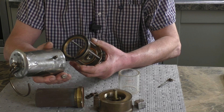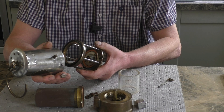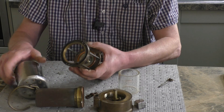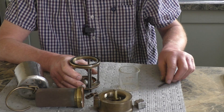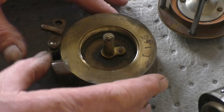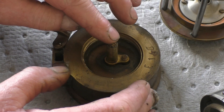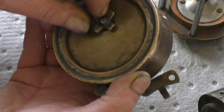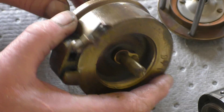This was probably used as a training lamp to train deputies in the use of the mine safety lamp. I've brought the camera in now to get some closer shots of the various parts. This is obviously the base of the lamp — it's quite heavy to stop things falling over. That's the wick there; it's got a little adjuster wheel on the bottom so you can regulate how much wick stands up or comes down.